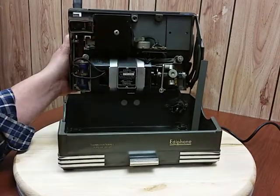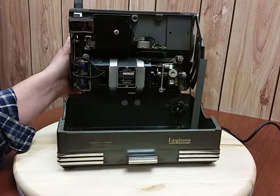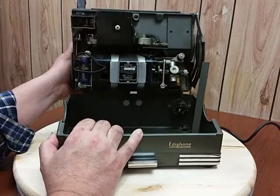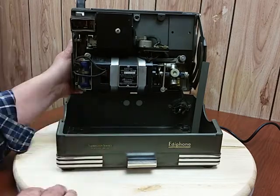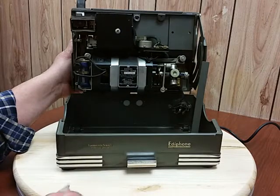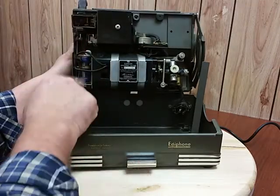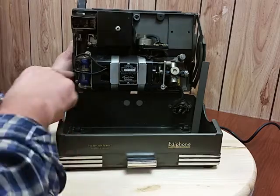This box houses the solenoid that controls the mandrel. I'm not able to control it, it's basically just there. It's mounted on rubber grommets, which had hardened and cracked and for the most part were gone. So what I used was mold making putty, found it at Hobby Lobby, because I also make plastic models and stuff. It's a two-part putty that you rub together, and within a minute it forms rubber. So I made grommets out of that. It works fine. That's your on-off switch there. This is the rheostat for the master speed control. I don't think there's really much else.